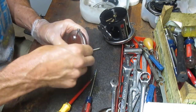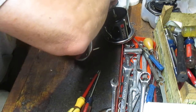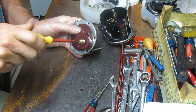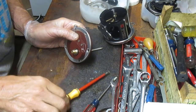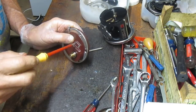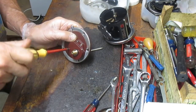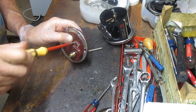Just a couple of partial turns until the other bridge plate screws are set. Again, the partially threaded screws go up top — you saw the springs that ride on them. I haven't brought all of these down fully tightened yet. I go in an X pattern, right to left, up to down, until all four are seated, then finish tightening in that same X sequence, low to high. That's to keep proper tension and torque on the entire bridge plate.